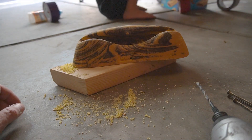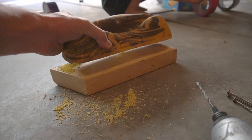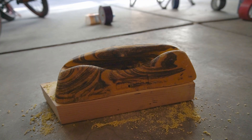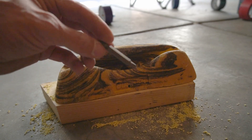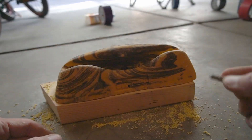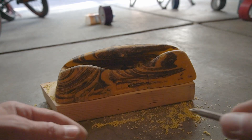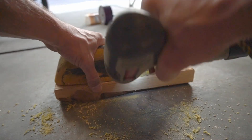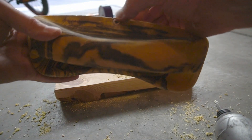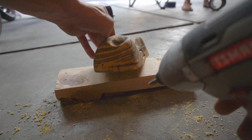I think that'll do for the initial holes. Now I'm going to make them a little more open on the first part so they can flush mount. I just discovered I don't have a bit that will work well for the flush mount, so I'm going to ad hoc this a bit. I'm going to use this old beat-up phillips head bit — it's not the intended purpose, but since it's plastic I don't care what happens to the bit. I'm just going to use it to do a little grinding. It's pretty flush — coming up a little on one end but that's going to be close to the wall. Pretty darn flush, so I'll continue. Sometimes you've got to work with what you got.